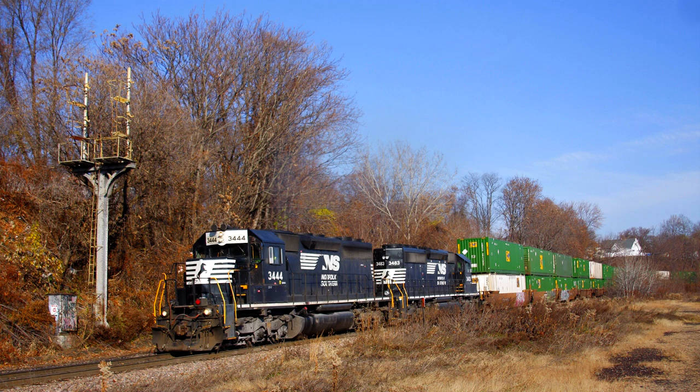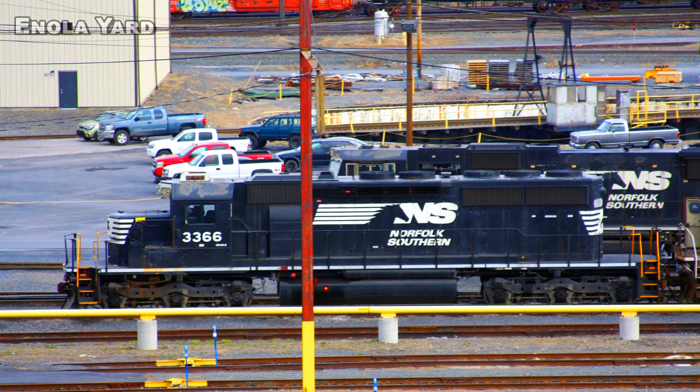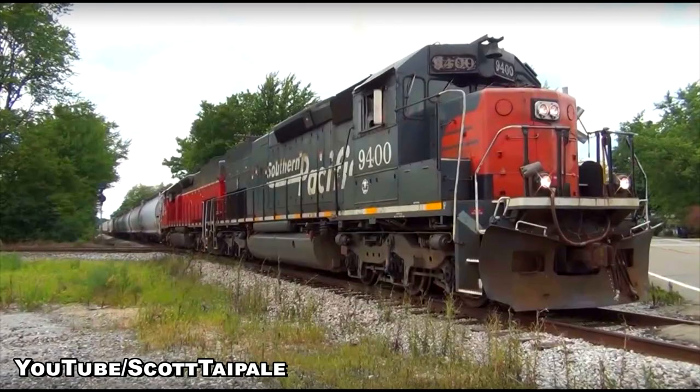The SD45-2 had a single exhaust stack and 3 radiator fans spread out over a distinctively longer hood that filled the extra frame length. Tunnel motor variants, the SD40-T2 and SD45-T2, rode on a still longer frame and had a redesigned radiator area with low air intakes, internal fans, and roof-mounted radiator grills.